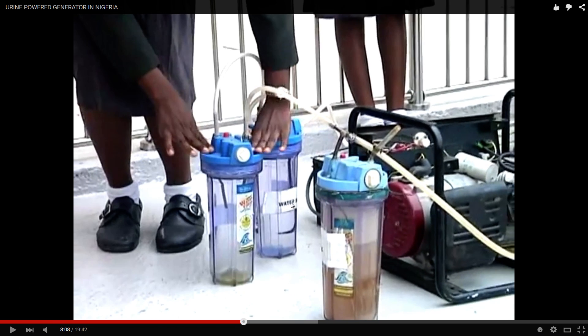This is the water bubbler — a hose comes from the electrolyzer cell, goes into the water bubbler, bubbles up, then goes through a hose into the storage tank, which is just an empty bottle. Then it goes through another hose into the borax dryer solution, where moisture is extracted from the gas, and finally out to the generator.